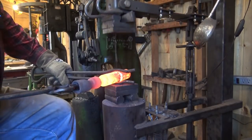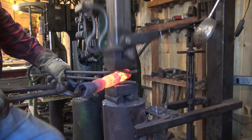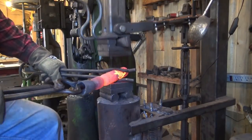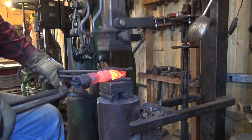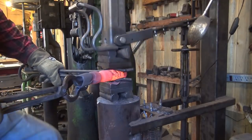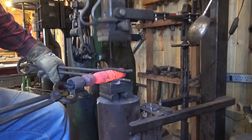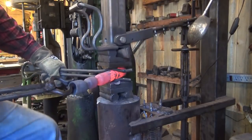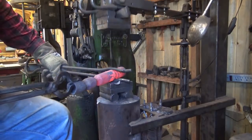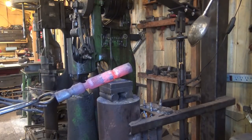There have been some questions on the treadle hammer — what is it exactly? I will do a short video on these special tools just to highlight what they are and how they work. In essence, the treadle hammer is a foot-powered hammer. It has a 60-pound head weight and garage door springs that raise it up. It will hit as fast as I want to stomp with my left foot, and if my left leg gets tired I can switch to the right leg — it has a backup drive system that way. We will do a more thorough video on just the treadle hammer.